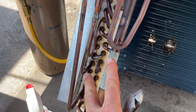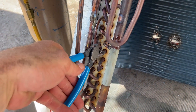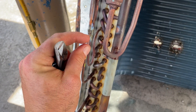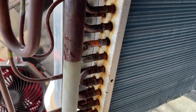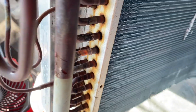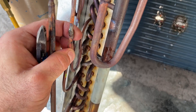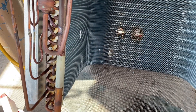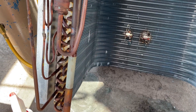Got this circuit isolated right here, and my favorite way to do that is just to snip this with dykes. Then I leave the ends close but with a gap like that, and just cover the entire thing with braze. That helps stabilize everything and obviously seals it up really well. So now this entire circuit is removed — that will affect the efficiency some, but not that much.